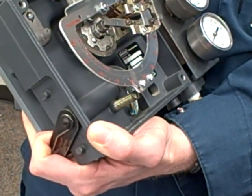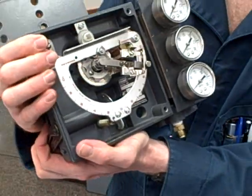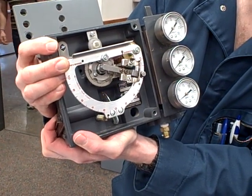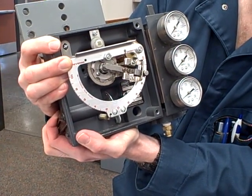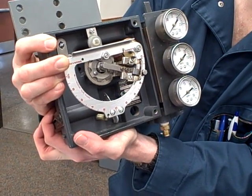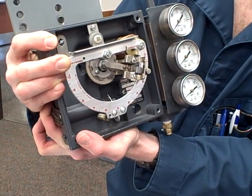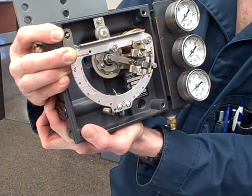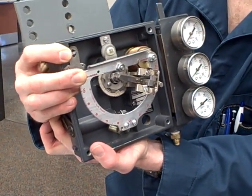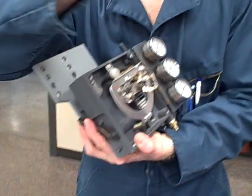See how they have opposite effects? I'm going to coordinate the two motions right now. This starts to inflate, brings the flapper closer. Builds up pressure, valve moves up, flapper moves away. Increase the pressure more — flapper closer to the nozzle. Valve moves up more, flapper moves away. It balances. Increase the pressure even more — flapper towards the nozzle, valve goes up even more, flapper backs away. Motion balance system — like two dancers: one person steps forward, the other one steps back to keep the gap between them constant.